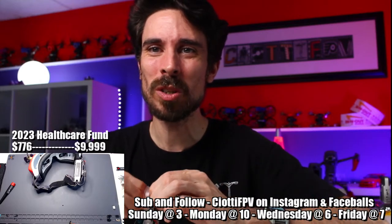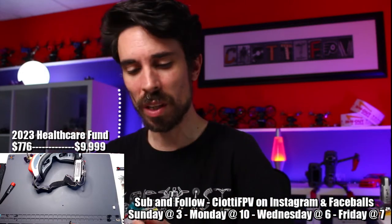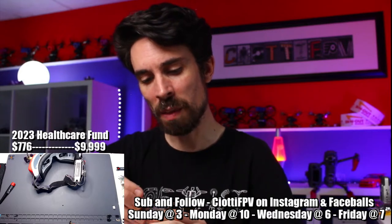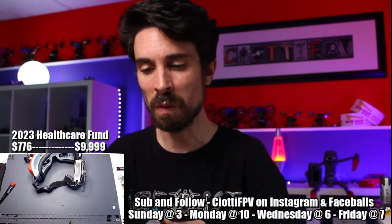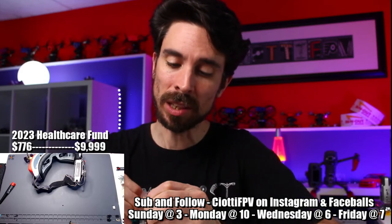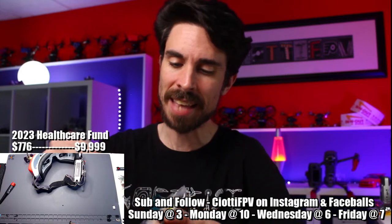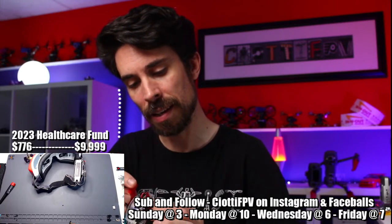Butterdurtson says, could be motor startup ramp-up power. I think it was Newbie Drone that recommended maxing it out on Blue Jay. That wouldn't really affect the raw amount of power that this thing is kind of lacking. And usually the startup ramp-up power will show itself, if it's too low, as the motor twitching at lower throttle values. It usually won't, when you ramp it up to full, it overcomes that. So I don't think it's that. It could be, anything's possible, but my guess is that it isn't that.